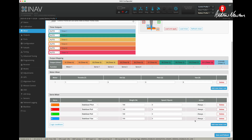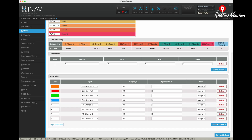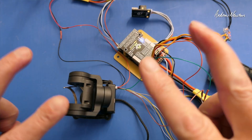We go to the mixer — this is the standard mixer for a plane — and we need to add four more mixer lines: servo 5, 6, 7 and 8, connected to pins S7, S8, S9 and S10. All we have to do is put in the channels we're going to use: channel 6 for S7, channel 7 for S8, channel 8 for S9, and channel 9 for S10. That's just passing channels 6, 7, 8 and 9 from the radio straight through to those pins, giving us mode, gain, pan and tilt controls. That shows you how to set up PWM control either with a receiver or a flight control board, without needing the gimbal config program. Thanks for watching, see you in the next video.